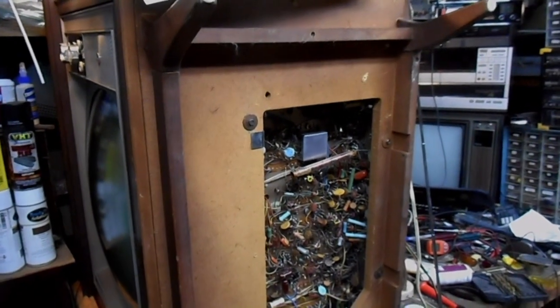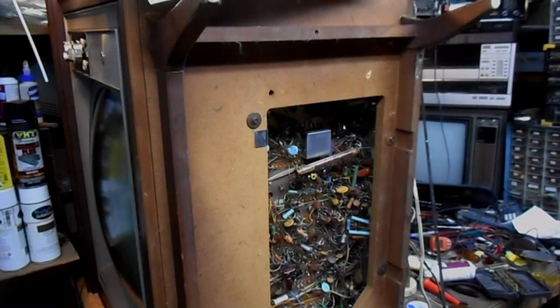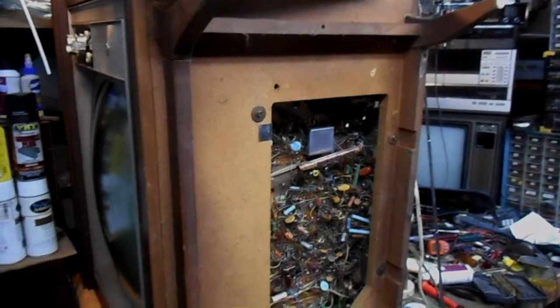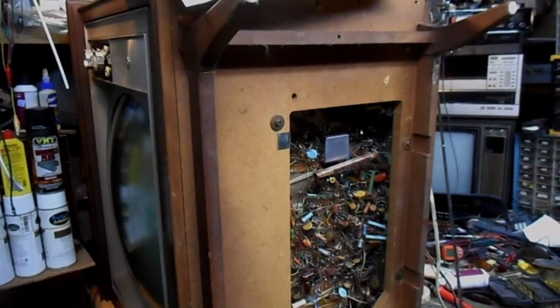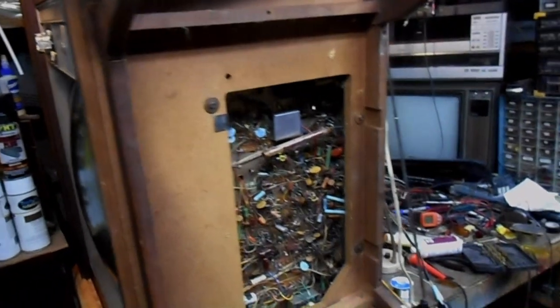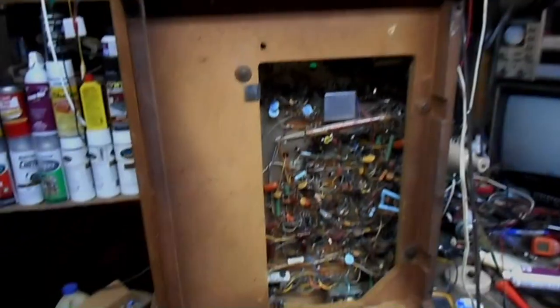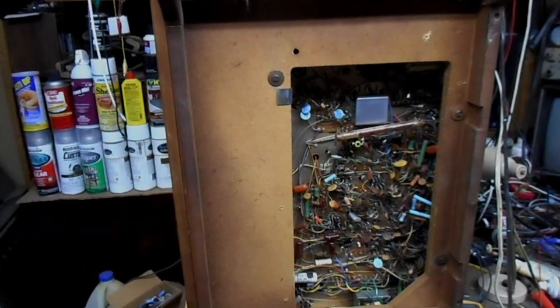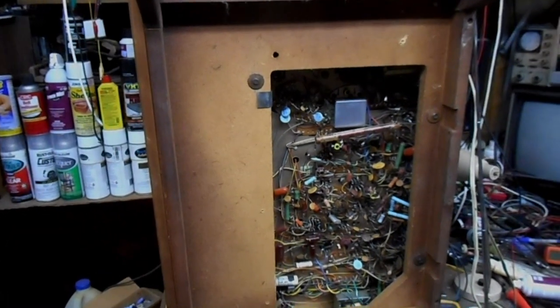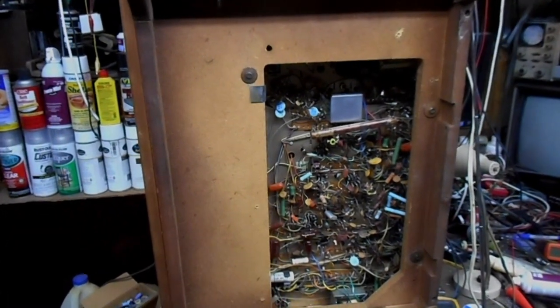I think what is responsible for that is a purity issue in the picture tube causing a weakening of the yellow in the localized spot where the test pattern happened to have it. So I'm going to put this set down on the ground and then run it through a complete purity and convergence setup and take you along for that ride.